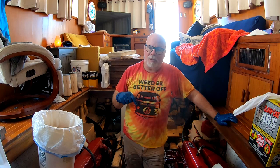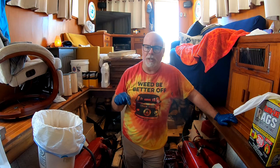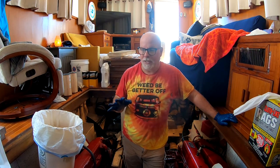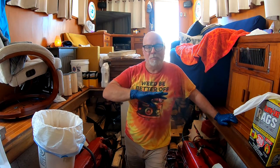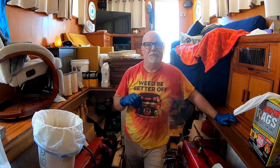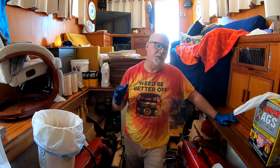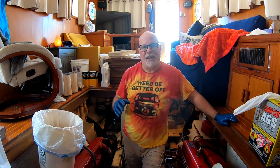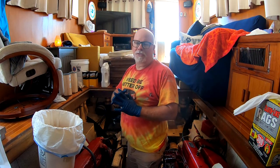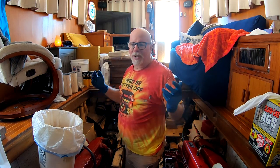Leave your comments below if you have any questions. This boat runs a Ford Lehman engine and that was my generator. Pretty much all engines run Racors — I don't think I've ever seen a diesel trawler that doesn't have Racor filters in it. It's just something you should know how to do. I've got to get back to work: I'm changing the oil in the generator today, changing all the gear fluids — a complete fluid change to get it ready for the whole season.